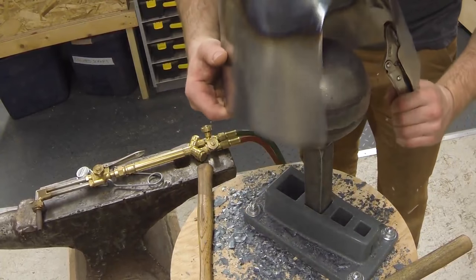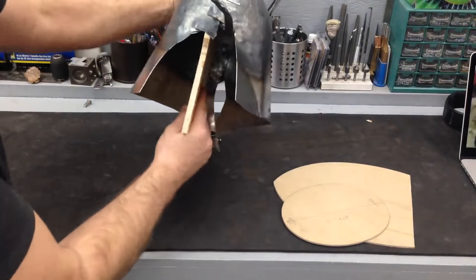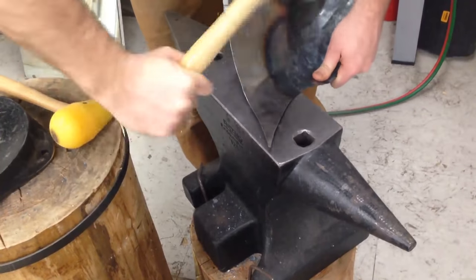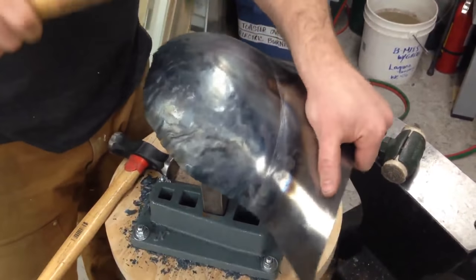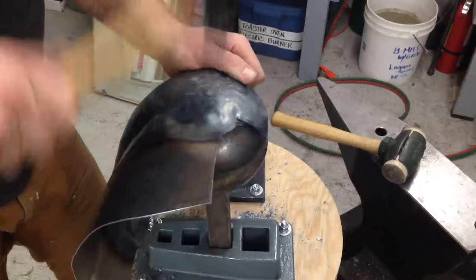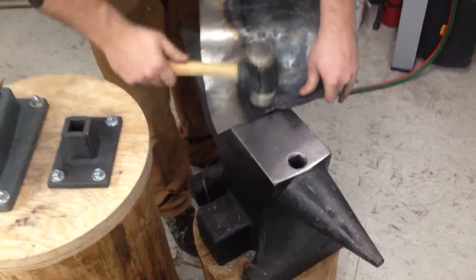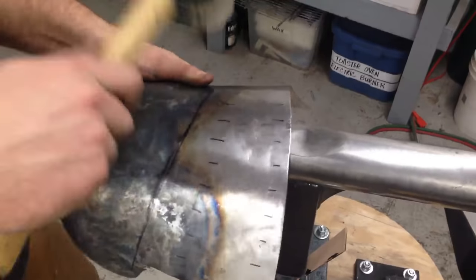Here I am just doing a rough comparison of the two halves — I just want to get them approximately the same shape so I can clamp them together. I cut some templates of exactly what I wanted the finished helmet to look like out of wood. Here I am using a plastic mallet to just rough out that tail a little bit. Now I'm going to put a crease in one side — this will be the line that runs down the side of the helmet. Doing a bit of planishing here, just smoothing out all those bumpy bits. This helm I wanted to have a fairly rough finish, so I leave it pretty rough from the hammer.